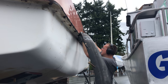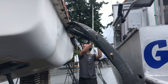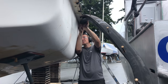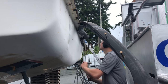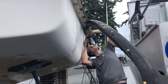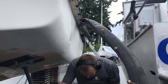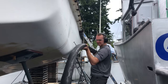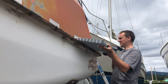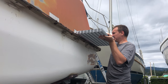We originally thought the deck would be made out of wood, which we would then encapsulate with fiberglass, but we realized pretty quickly that that wasn't the safest idea. We weren't worried about it falling off the boat — rather, if we were rolling around in any sort of sea, which, let's face it, this boat's going to be a bit rolly, we didn't want those side decks to act like big scoops going down in the water and having a hard time shedding liquid. So we turned our idea to something that would be very quick to drain. I'm going to show you the solution we eventually came up with — Torrin's testing out a sample of fiberglass grating, which we got from a company called Fiberman, and eventually turned into our deck.